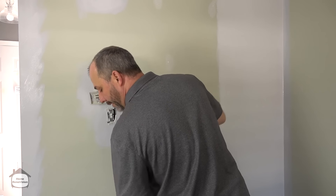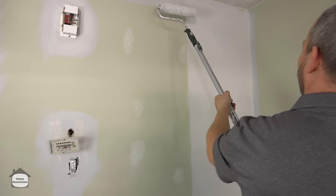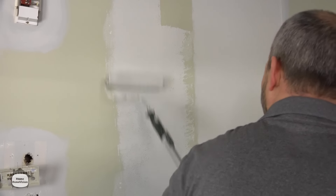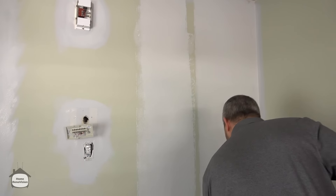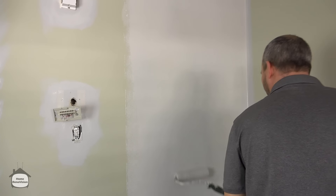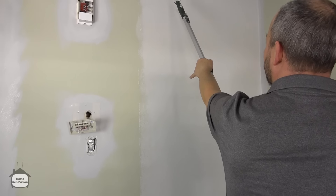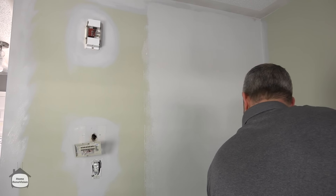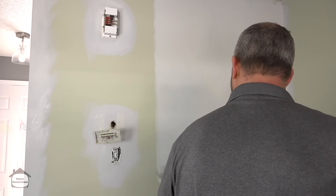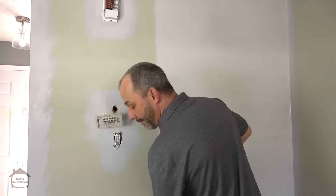Load up, clean it a little — don't be too aggressive or you'll throw paint all over the room. Step back where you're comfortable, start from about a foot down. See that gap? Slowly add a bit of pressure, then work your roller backwards until you're overlapping. With two hands the pressure is comfortable. I'm extended here with my back straight — this is ergonomic painting. This is not going to fatigue you. You're going to get a perfect roll — no drips, perfect coverage, no sore back.